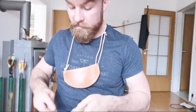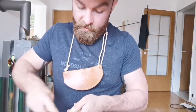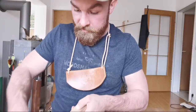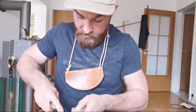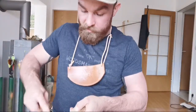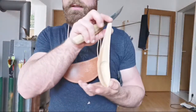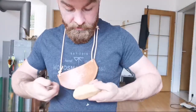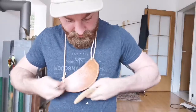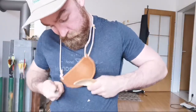A quick strop. I can't tell you enough good things about stropping. It's really what most carvers do — depending on the carver, between 60 and 80% of the time we're actually stropping rather than going through any type of sharpening process. This is really just a fine honing stage, and done in the right way with the right strop and materials, you won't have to sharpen a lot at all. Oh yeah, that is rifling through there. Looking forward to April's edition of the all-round combo — it is coming. We're just on the final planning stages because there's going to be a couple differences to last time's tool drop.